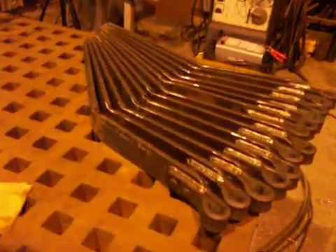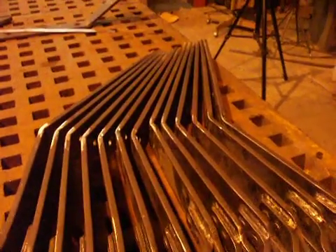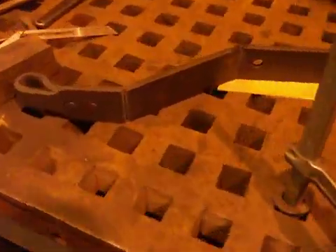I'm in the process of shaping the chain plates so that they'll fit the hull. There's going to be two bends. We've finished the first bend. How that is accomplished is to use a saw and cut most of the way through the chain plate, which is hard to do when you've spent so much time and effort working on something and then start cutting it into little pieces. But then it is welded back together and good as new in the new bend.